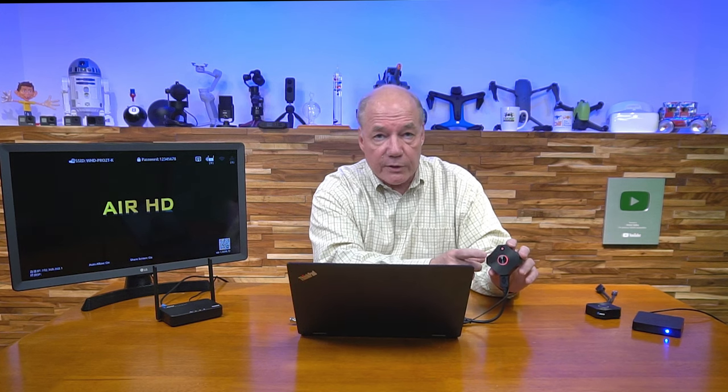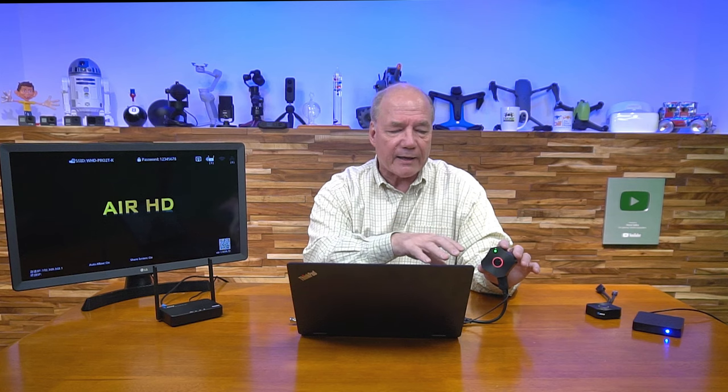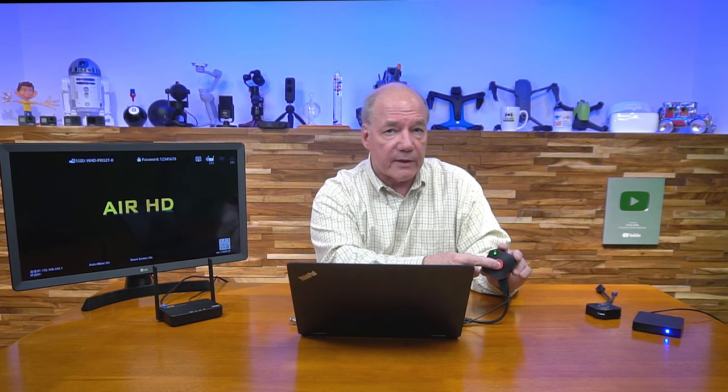Let's connect up one of the transmitter modules, starting with the laptop. On one side there's an HDMI connection, and right next to it a USB-A connection for power. The moment I add power by plugging in the USB-A, it starts an internal power-on self-test checking the electronics and checking the resolution of the media stream so it can make adjustments before broadcasting to the receiver. Once that's done, the indicator goes solid red — it's ready to transmit. I like that it doesn't just start transmitting automatically; it gives you control. Tap the button once, it turns white, and it starts transmitting to the monitor.